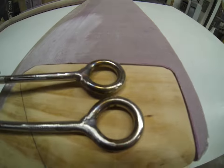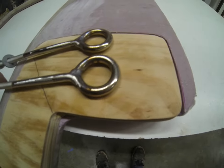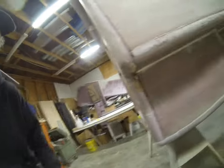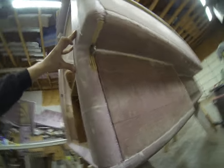I didn't resist. Off camera, I welded up the split in these guys — a little 309L rod and some DC TIG. Alright, with some final fitting and fooling around here, I think I'm pretty happy with how these are going to end up.